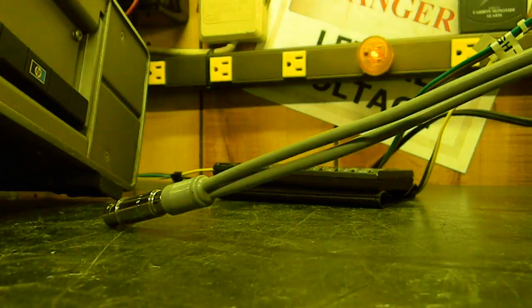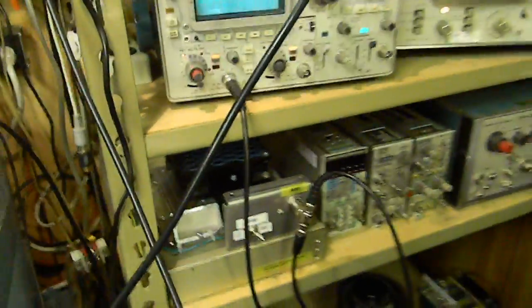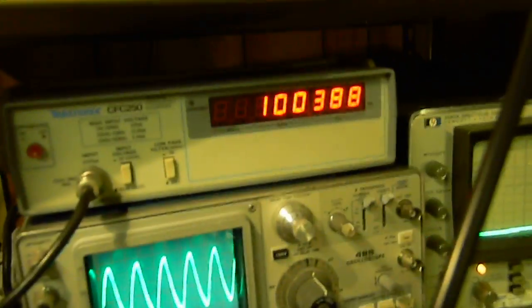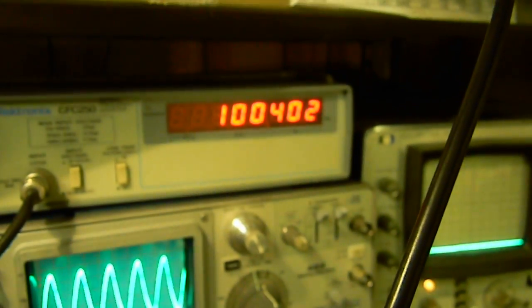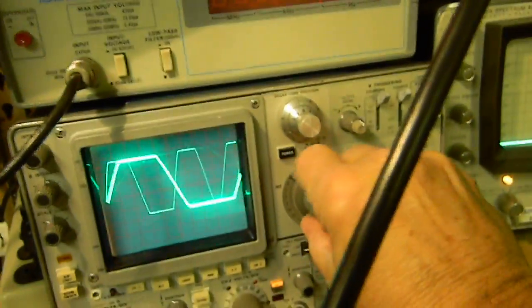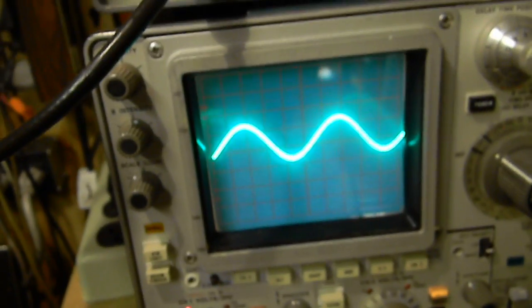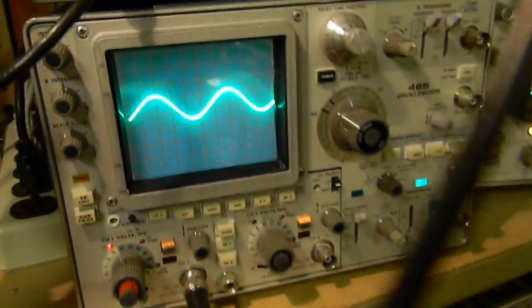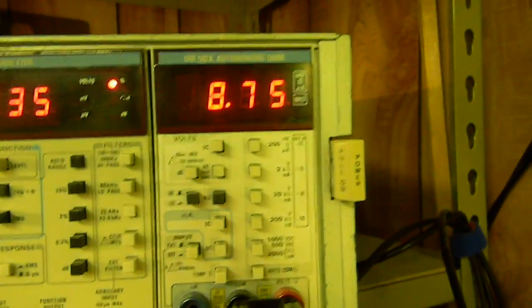The reason I'm doing this is because this HP over here works quite well at low frequencies but has some problems above about four or five kilohertz. I'm plugging it back into the amplifier so we'll have reasonable levels of distortion to deal with. The amplifier we're driving is an old McIntosh MC275 operating into a couple of dummy loads — they're getting sort of warm. We're watching on an oscilloscope and spectrum analyzer. We're at one kilohertz — there's our sine wave output, nice and clean — and we're driving the amplifier at maximum output.